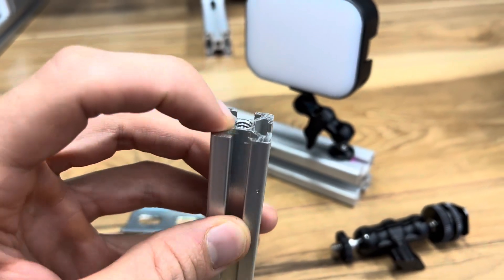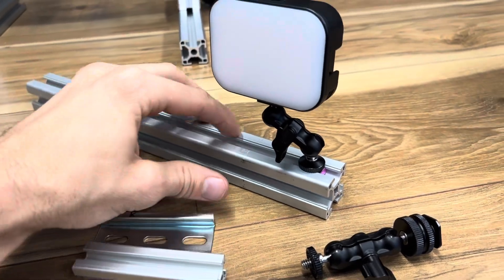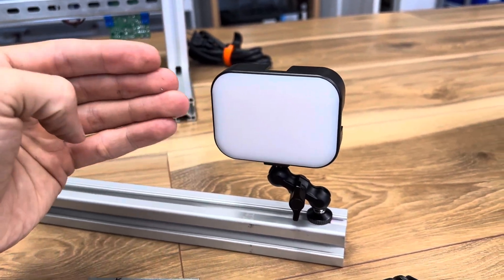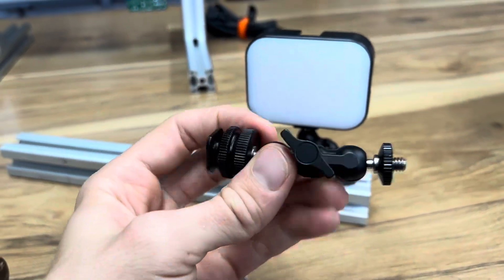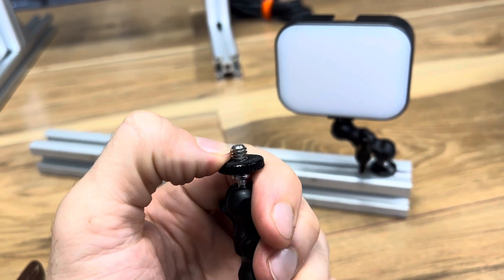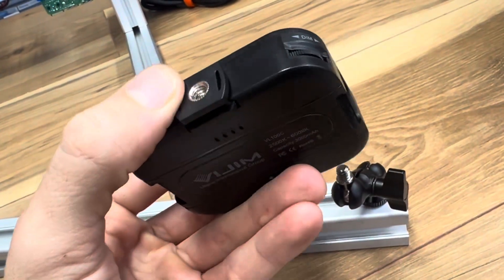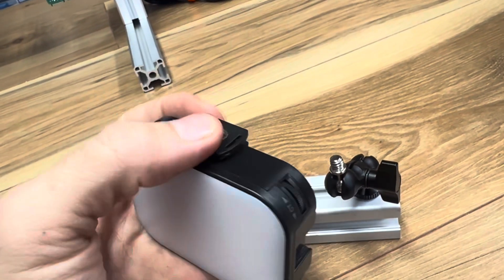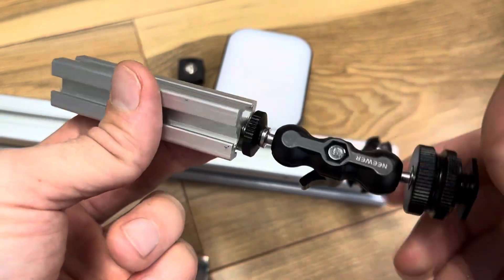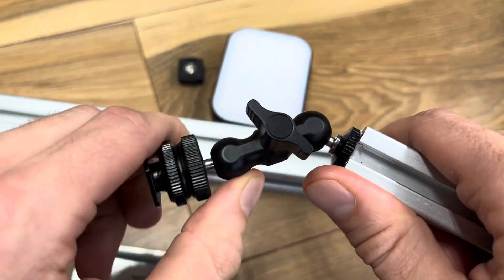These 2020 extrusions are perfectly suited to go straight into tapping at the end of the joint, such that you can hold any kind of bracketed device like a light, microphone, camera, etc. These little doodads made for cameras and so forth are always quarter-20 threads — the same as a camera mount or something on a tripod that you find at the store. Once you've tapped it, you can easily secure any kind of bracket from the camera working industry.